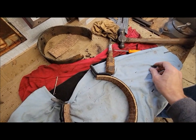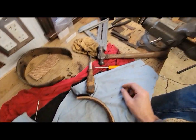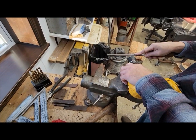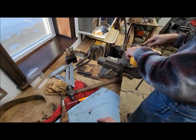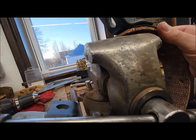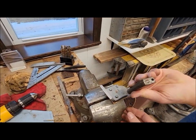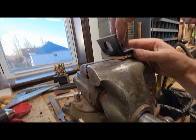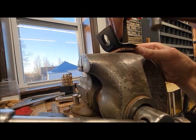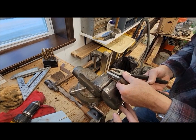That's all there is to it. And then our solid copper rivets are here. The ones we have on hand, the heads are just a little bit too big, so we'll put them in the redneck vise here, or lathe, and make the heads a little bit smaller so they fit. So we got just a punch clamped in the vise as a backer for the head of the rivet, and then the rivet set to squish it all down. Shorten it a little bit. Get to the proper length.